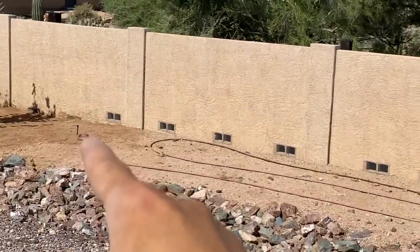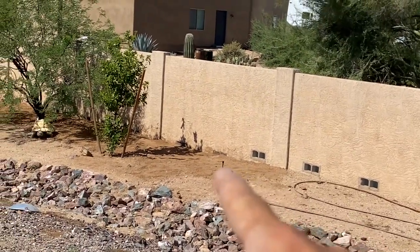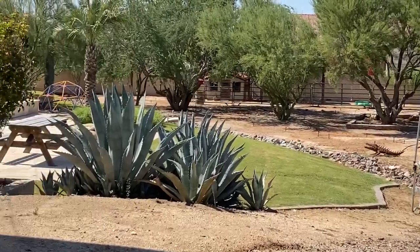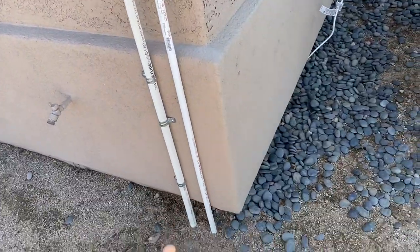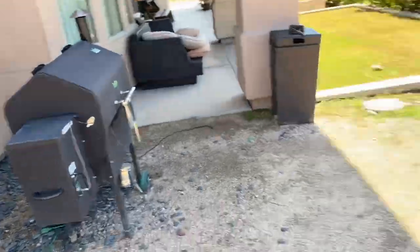So we went ahead and finished installing the entire irrigation system. This is day six. Sorry for day five not being on video — there was a lot going on, a lot of work being done. Right over here you can see there's a half-inch perforated line looping around. This is going to cover a lot of shrubs and plants that need water more frequently. Right next to it is a bubbler, and there's a bubbler next to the orange, with bubblers throughout the area. And over here is the timer — it's all set up. It plugs right into there, though you're going to need some kind of cap seal to cover it.